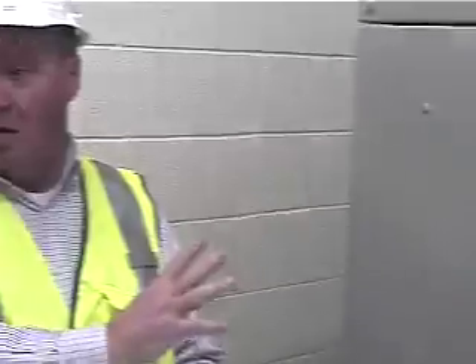I'm Clark Louder with Steven Sales, locally here in the state of Utah, where the Cooper Power Systems rep. This is my son Miles Louder, and I'm glad to get to come and talk to you guys today about this switch. You have a number of them on campuses — the one over at the Digital Learning Center is insulated with SF6 gas, as well as this new version, which is exactly the same components but insulated with a synthetic version of our FR3 fluid we call E200, which is a derivative of soybean oil. That's what is in your transformer that we'll talk about later.